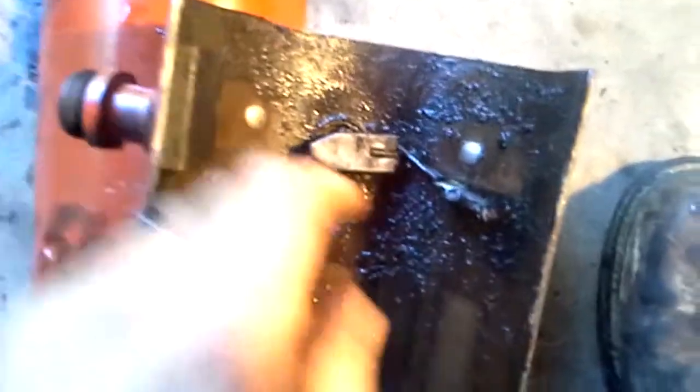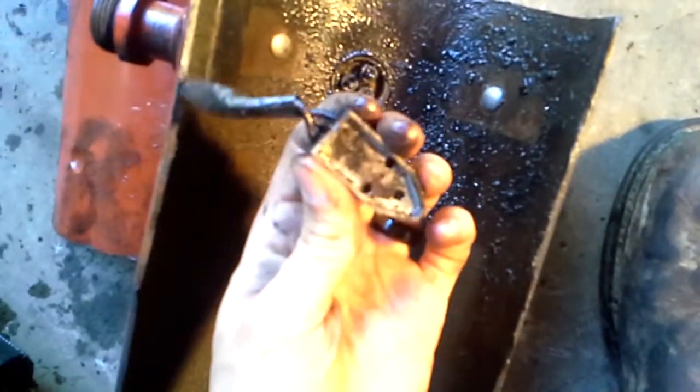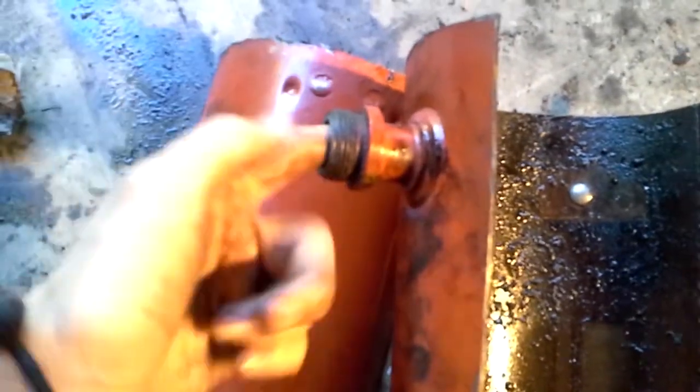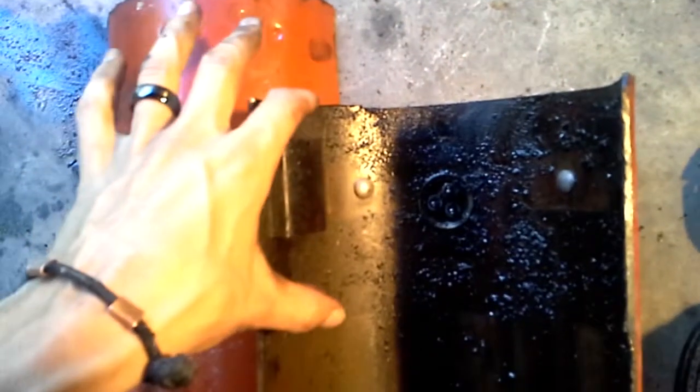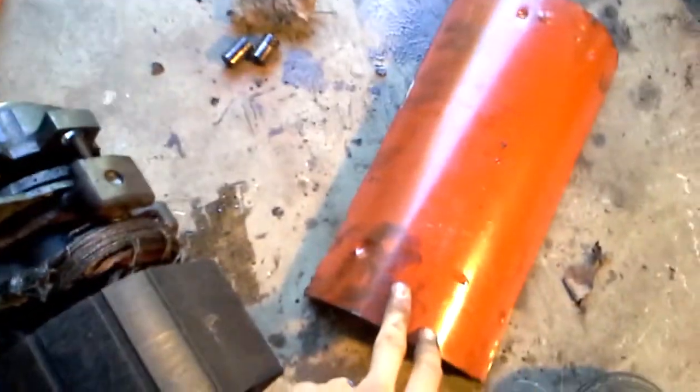The original problem was open windings. This is your plug — it burnt right off the stator. The plug comes right off and plugs onto the backside of your terminal strip, which connects to the stator. That's your suction inlet — there's no check on that, just a baffle to distribute vapor so it's not shooting straight in. It's directional, and it helps cool the assembly since the vapor covers the whole surface area. These aren't air-cooled, and if they were they wouldn't put blankets on them to reduce sound.